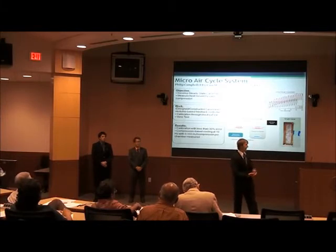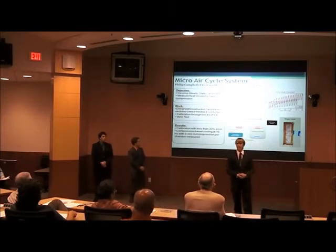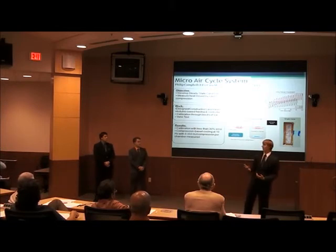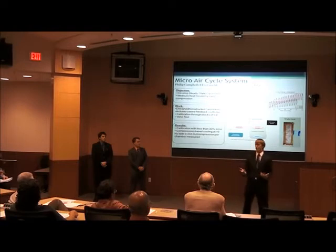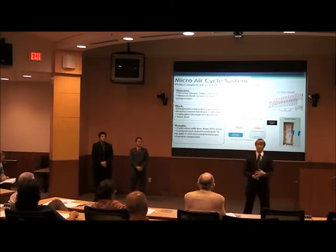After that, we actually tested it with a vane inside — that's the graph right behind me — at two different frequencies. The red curve is at 10 hertz, the black curve is at 20 hertz, and we were actually able to measure an effect of cooling. It's about four joules over 10 minutes, which comes out to, for the 10 hertz case, about a third of a millijoule per compression, which for us is actually a very, very small amount of heat to be able to measure.